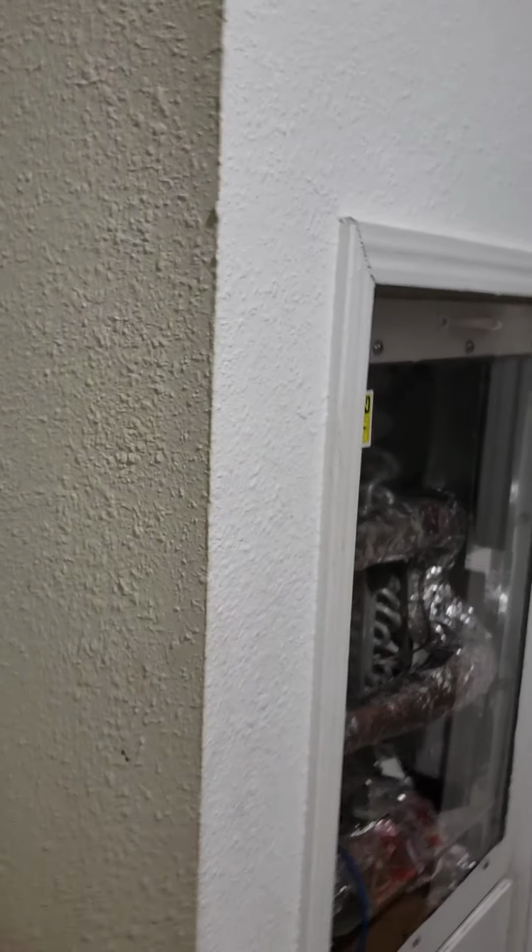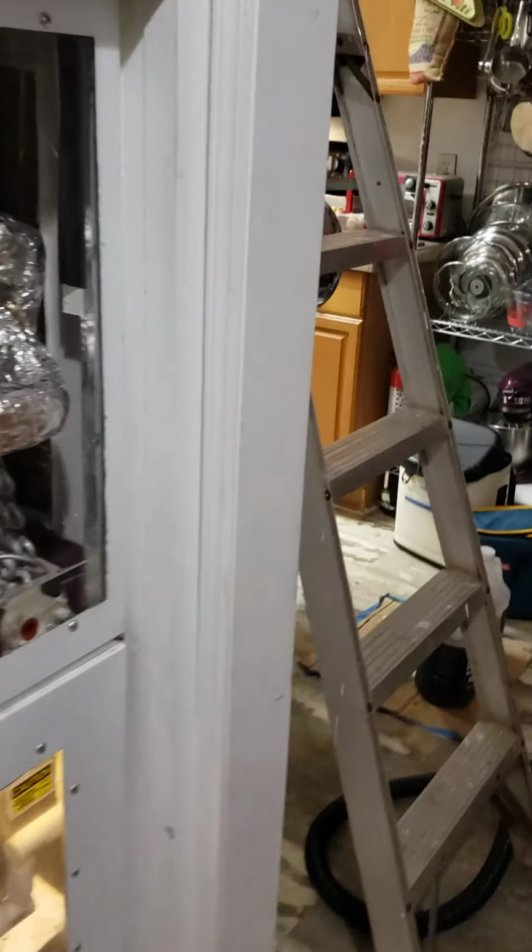But really, L&I, which I'll send this video to them for the state of Washington, you really need to change the guidelines that if you're going to allow for this type of setup where the HVAC system is just stuffed in a closet with sheetrock, you need to make sure that there is this type of insulation there. And you don't want to use any other type of insulation in that wall, because fiberglass will wick moisture, and it's not a good moisture preventative.